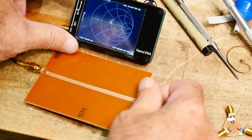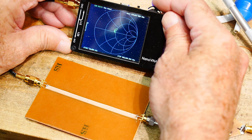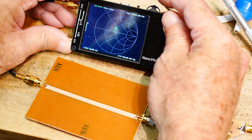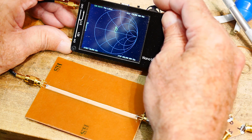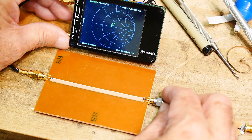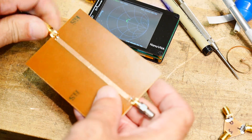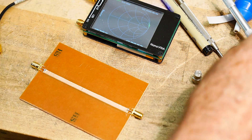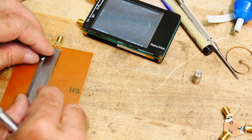Oh, look at that — very nice, very very nice. We are very close now. 41 ohms, 43 ohms, 44 ohms. So it's very, very close now. That might be good enough for a lot of intended purposes, but I think we can get a little bit better. The calculation said 100 mils, 0.1 inches, should be 53 ohms — if I entered all the right numbers. So let's go ahead and remove more.